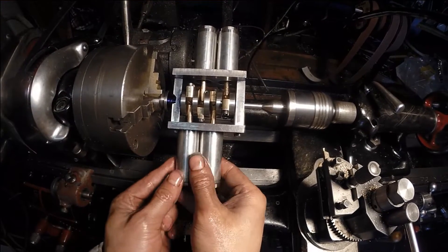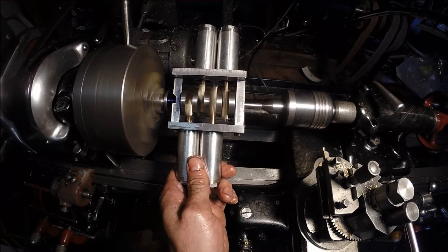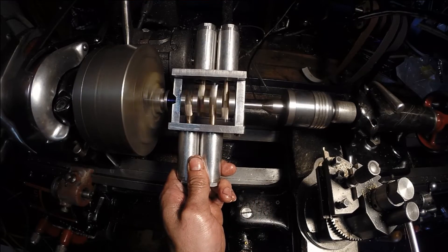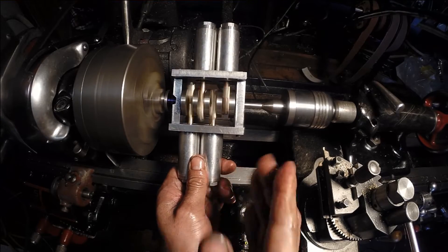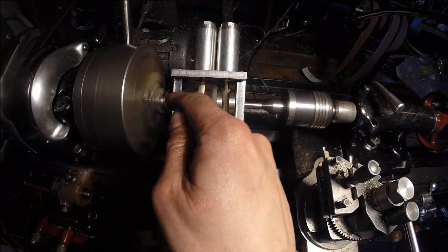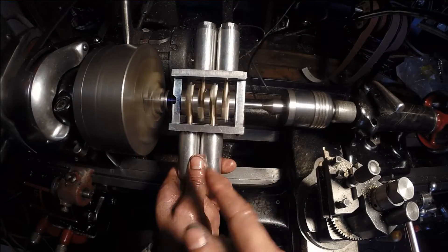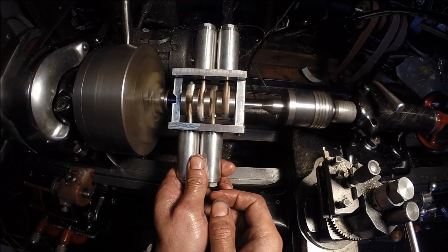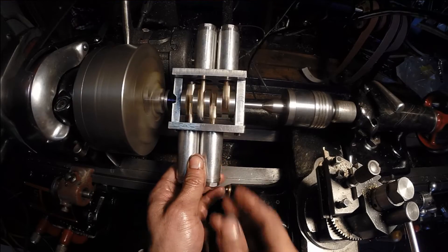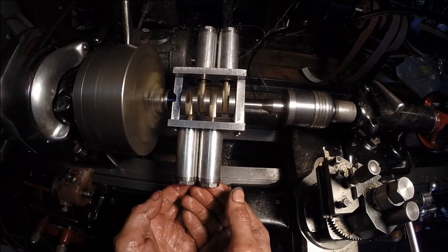Let's run it in a little. There's a little bit of vibration, so it's probably not running too concentric. I think it's from that piece, the eccentric that's on the end, because I remember when I put it in there it was a little loose. But there's like no resistance so far.